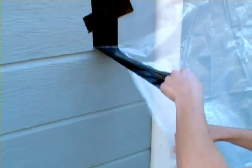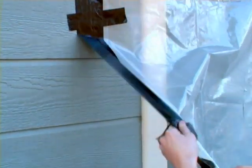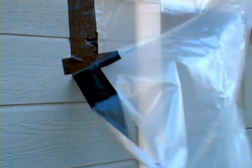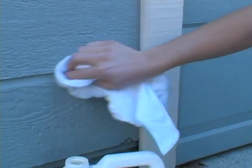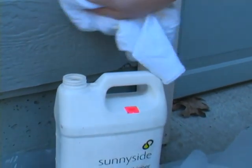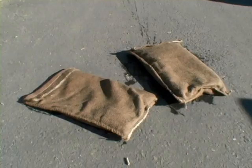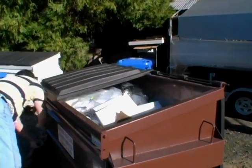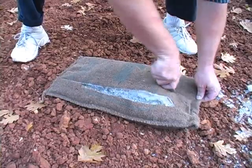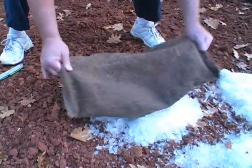Removal of the screen and bag disposal. Removing the plastic and bags after the storm is simple. Carefully peel the plastic and duct tape from the siding and door surfaces, taking care not to pull off any paint or siding material with the duct tape. Any residue left by the tape can be removed with a mild solvent such as mineral spirits. Dispose of the storm bags by either letting them dry out over several weeks and placing them in regular trash disposal bins, or cut them open and spread the non-toxic biodegradable gel around on any flat surface to break down and disintegrate over time.